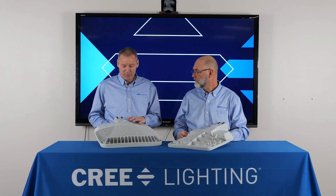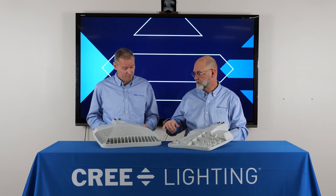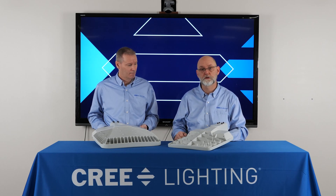So we have the receptacle location moved from the B to the C — tell me about that. Great question, Dwayne. When you look at where the photocell receptacle location is on the B versus the C, you'll notice it's moved back a little bit further into the mounting arm. The advantage of doing that is it takes the photocell receptacle and moves it into a wet location space so that in the event of water ingress, it's in a safe space and can safely drain out the back of the arm without causing any damage to the electronics.